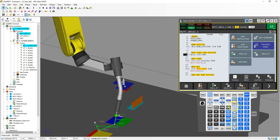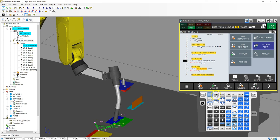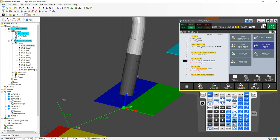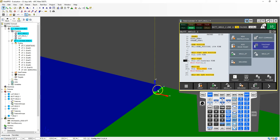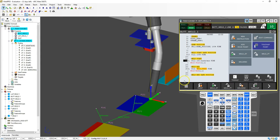So we go from there down to here. I'm going to go step mode and go forward to my start position — that's my weld start. Turn off step mode, turn off shift. If I click the end, we'll get our position. I'm going to switch from tool mode to world mode, bring it along my path, and go right close to the end again — right around there. That's going to be my weld end. I'm going to go to where it says weld end. Here's my linear path. We're going to take the welding speed over to that, so I'm on 15. Go shift, touch up. Now that is a touched up position.